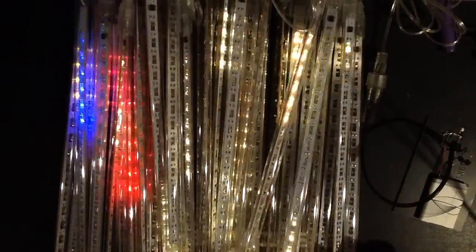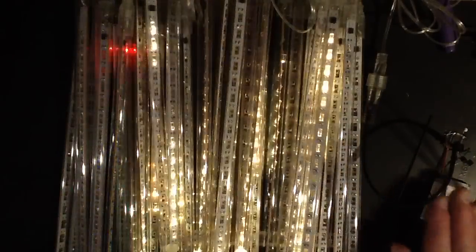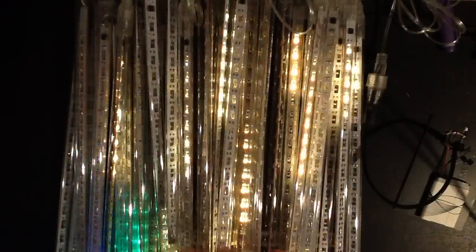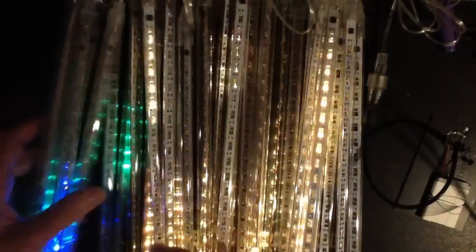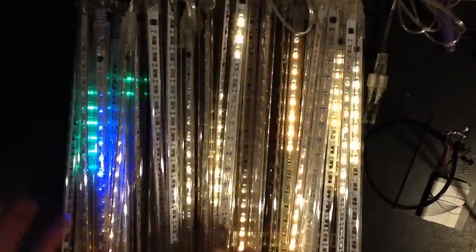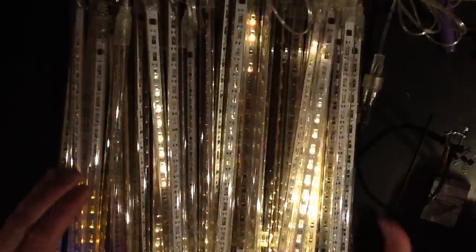Okay, quick update because I've been playing about, I've been adding strings on. With the 10 ohm resistor on a lithium cell, having said that, it's not at full voltage. At the moment, I can comfortably drive, with modest brightness, 4 sets of these. That's effectively 32 meteor strings. And of course, the fact I'm mixing colours here is probably going to be skewing that a little bit because the red and yellow will probably be pulling the voltage a wee bit lower. But that's pretty good. That's a really good result for such a simple circuit.